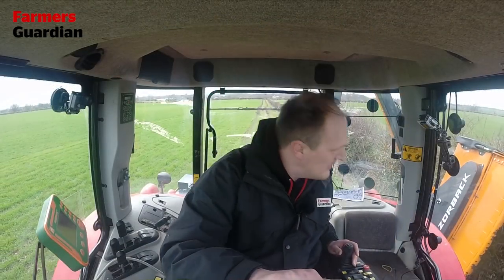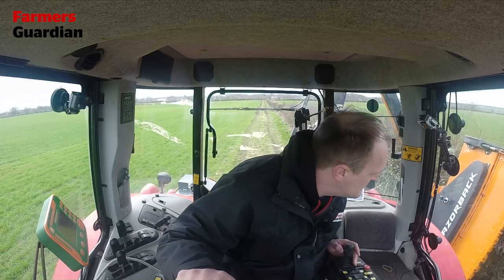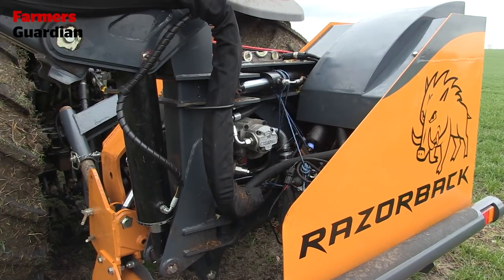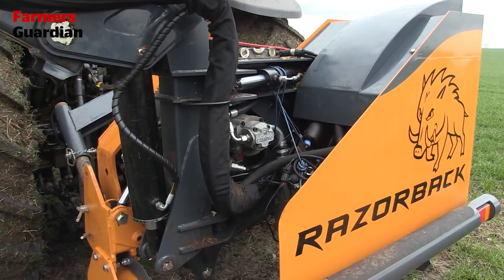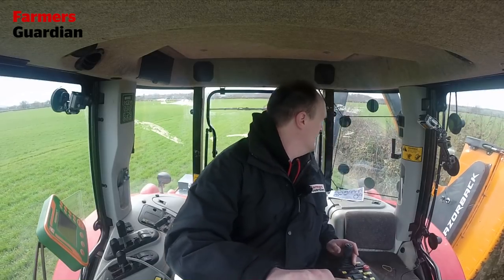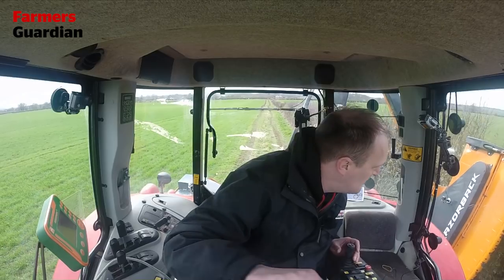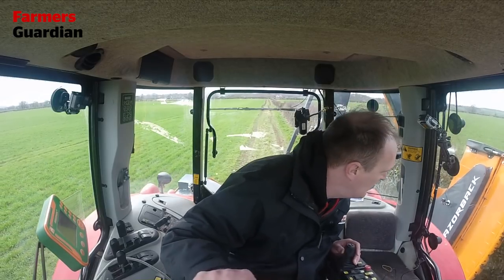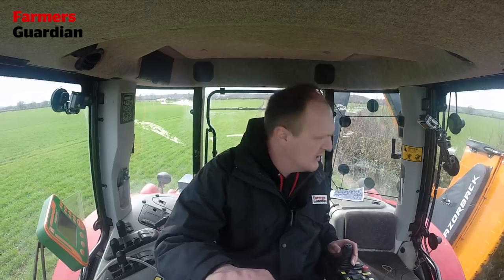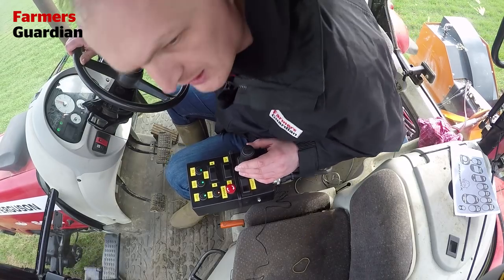So as you can see, we're in the field trying out the new Missouri Razorback Hedge Cutter. What a cool name — a Razorback — sounds like it means business. And as you can see, it does mean business. We've got about two years' growth on this hedge here, which at 1,100 revs from the tractor, powering a twin pump on the hedge cutter — one pump for all the controls and hydraulics, one pump for the head — it is managing that really, really well.